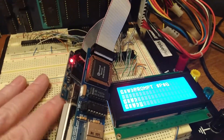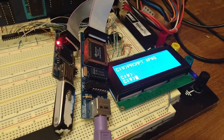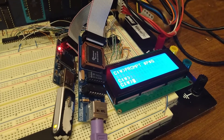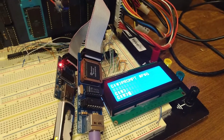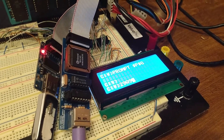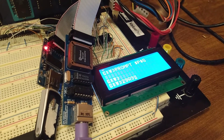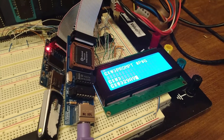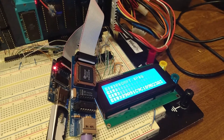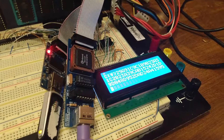So you've got our prompt here. This is read-only right now on the hard drive — it's just a matter of sitting down and writing the code. I could do a make directory and it would write back and make the directory. Here's our keyboard — I just pushed the spacebar and this is currently just giving you the scan code. I definitely need to write the keyboard driver. You can see there was key down, key up, and I just need to take that key down and key up and interpret it, then put those characters in the keyboard buffer.